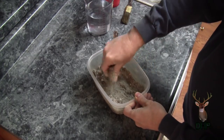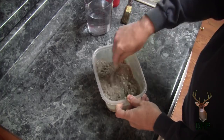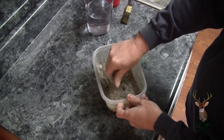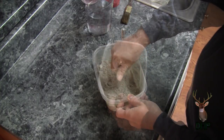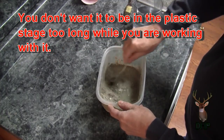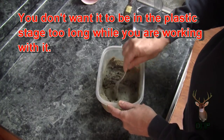The issue you run into with mixing mortar is adding water — it goes from too stiff to soup in a hurry, especially when you have small quantities like this. All we need is enough to coat our surfaces. We're going to add some water carefully, because if you add too much and get it too soupy, you can end up with a really weak mortar.